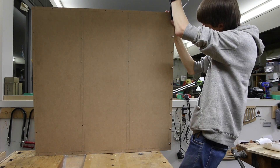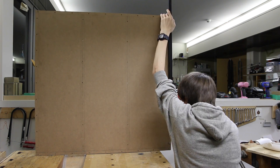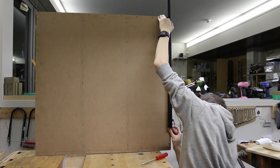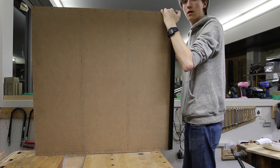Which isn't much fun with a 90x90cm sheet of heavy MDF. After that I made the holes a bit bigger on top so that the heads of the screws go below the surface. Then to clean everything up I also countersunk the holes. With all of that done I could connect the aluminium profile to the wasteboard using M5 screws and T-nuts on the other end that go into the aluminium profile.